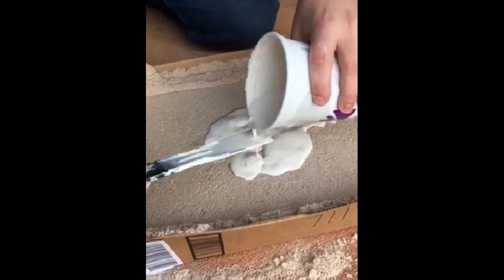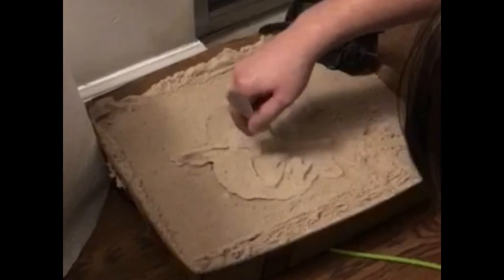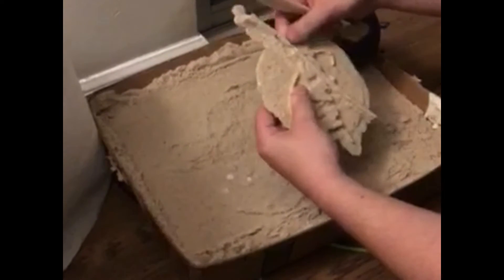Using the top of a cardboard box and wet sand, an imprint was created by pressing the negative into the sand firmly. Unfortunately, the first cast of the logo came out terribly. The problem was that the sand was not holding the imprint very well and the plaster was too thick, such that it couldn't fill the entirety of the mold.